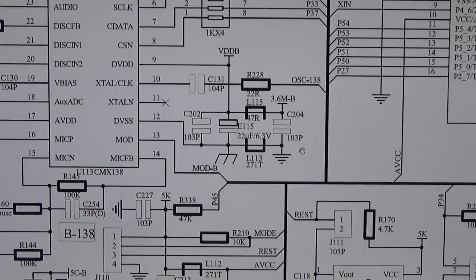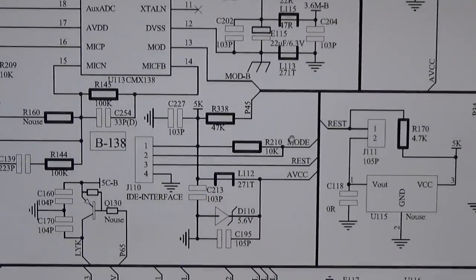What we find here as well is a Zener diode, and that Zener diode is connected to ground as overvoltage protection. When the voltage gets higher than 5.6 volt, this Zener diode will break through and protect our ICs. So, if we are lucky, this could be an answer.